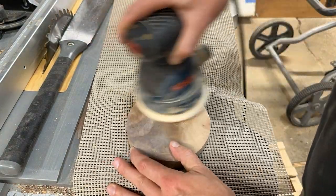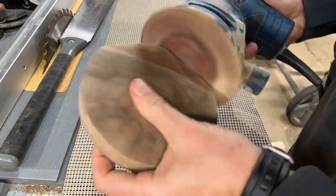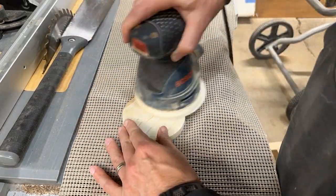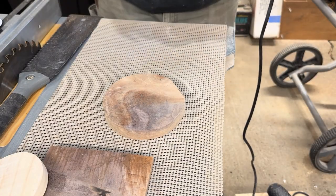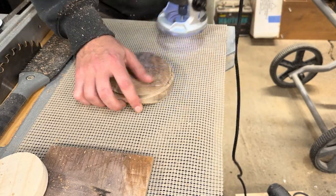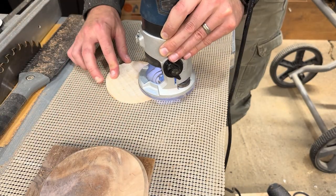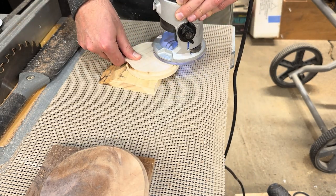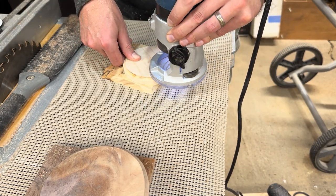In terms of sanding, I started with 120 grit, then water popped, then went up to 180, water popped again, went up to 220, water popped again, then 240, and I think I stopped there — it seemed like it was plenty. Sanding the corners and the edges was a little bit of a challenge, just trying not to leave scratch marks, but overall not too bad. I'm putting a 45-degree chamfer on all the edges just to give it a break from that hard edge, and I think it looks pretty nice. The ash burns a little bit, but if you take off some and then come back around with a really fine pass at the end, it does pretty good.